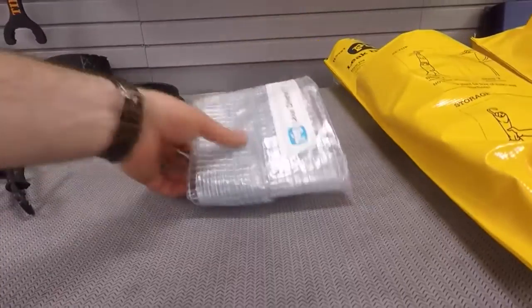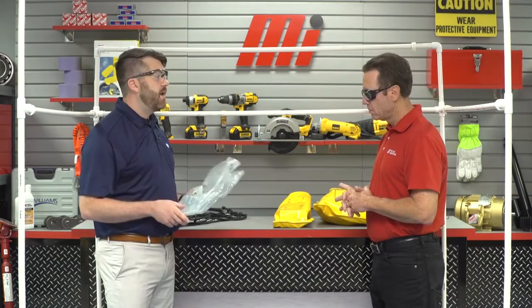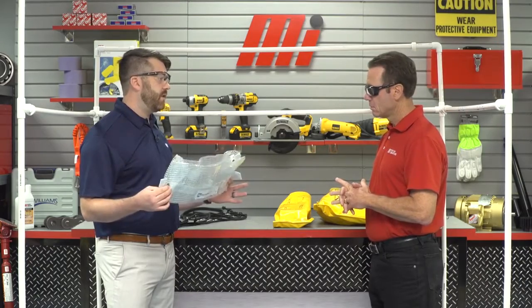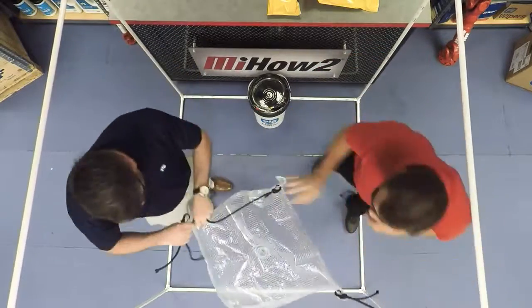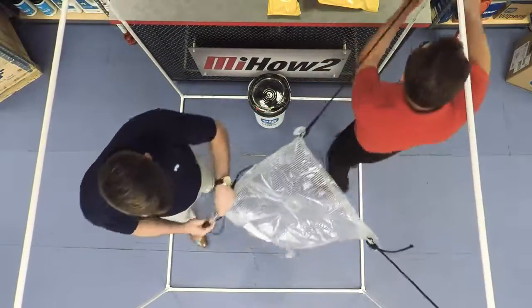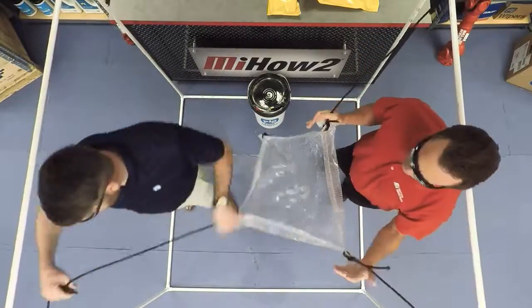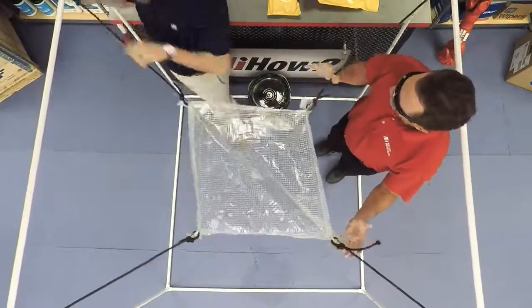We're going to start with our original Pig roof leak diverter today. It's offered in sizes as small as 2.5 feet by 2.5 feet, which is what we have here to demo. But they go all the way up to a 20 square foot size. So they get pretty big. All of our leak diverters are vinyl coated, and they accept a standard 3/4 inch hose to channel the water. They're also very durable to resist puncture and mildew. And these diverters can be hung with either rubber hanging straps or adjustable straps for uneven ceilings like we'll be using today. It's very simple. You just connect the straps to the 1/4 grommets.